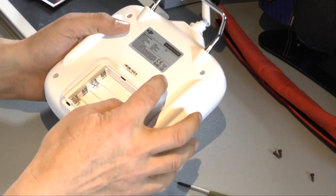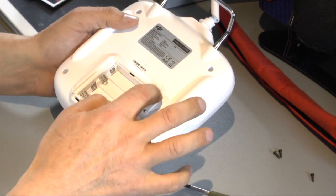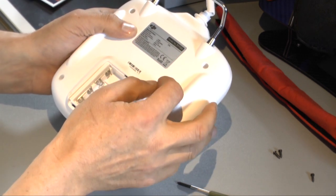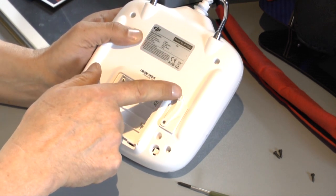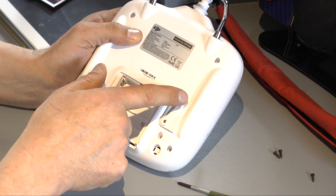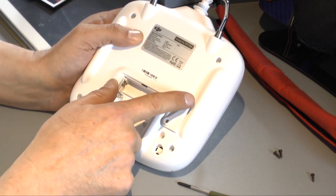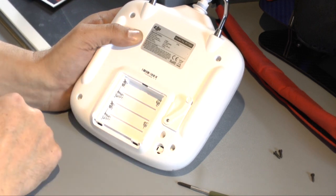You see it's a little bit open and the lever here is moving very easily, so you're not in the potentiometer. You have to push a little bit, and you see the lever moved a little, and now it's in the potentiometer. Now if you turn the lever, you will feel that it goes a little bit stronger, not as easy as in the first moment. That's the perfect sign that the lever sits on the potentiometer and you can work with the lever.